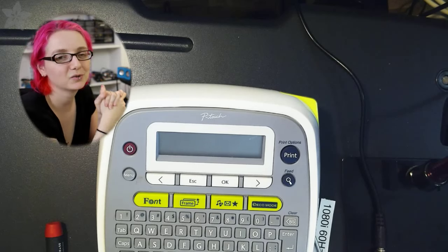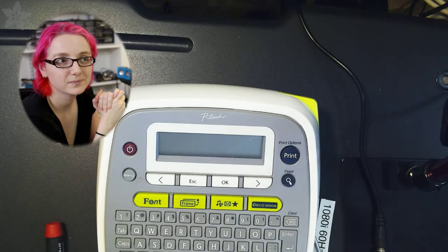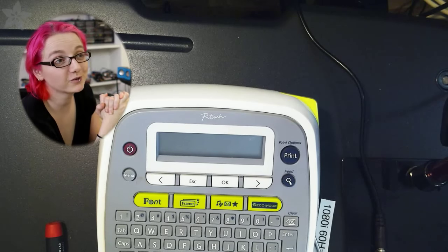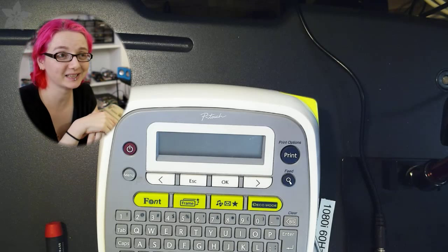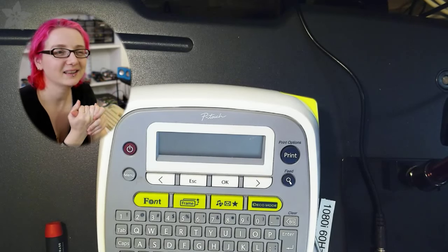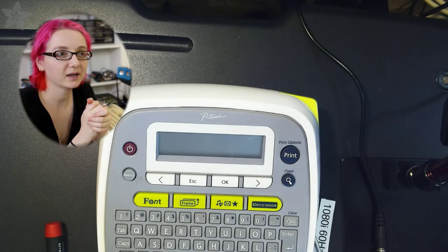It can't really damage too much more. Okay, maybe for a future show you can do how to test capacitors since they fail often. That's true, they do. One thing you look for is to check the tops and look for fluid leaking out of them, or anything bubbling out of them, because that's kind of the number one way you can tell that capacitors are broken.